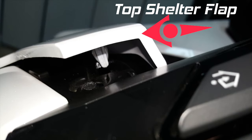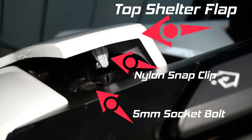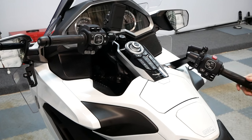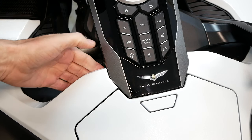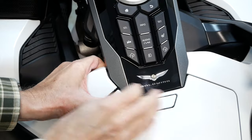Here you can see what we're going to be attempting to do in the next step. We have to raise up this shelter flap so that we can get access to that 5-millimeter socket bolt. We have to release this nylon snap clip, which fits down into another plastic piece, and it can fit in there very tight, so it takes some patience to release that clip. I'm going to start with the left side flap — this is actually a part of the top shelter. We're just going to release that snap clip, but you want to be very careful. You're going to pull straight up, and at the same time use your other hand to firmly hold that center panel switch in place.